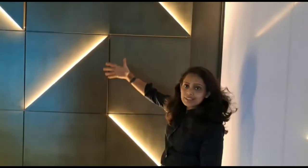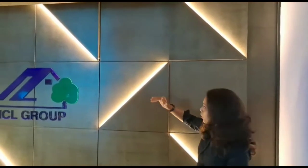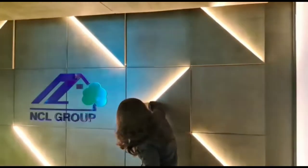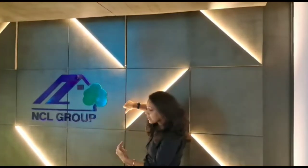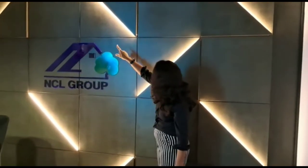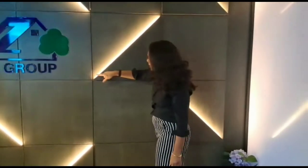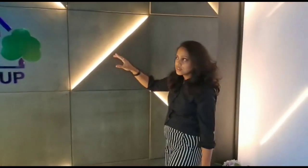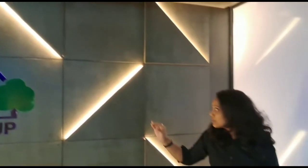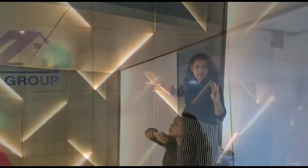See, this is the wall panel. The back panel, you can see. Basically you first go for a metal frame, an aluminium frame, and on that you install continuous sheets, and then according to your design plan you cut the 8 mm pieces and fix them. Here a profile light was installed. Like that, different designs you can do, with paint or pre-laminated board, both options are there.